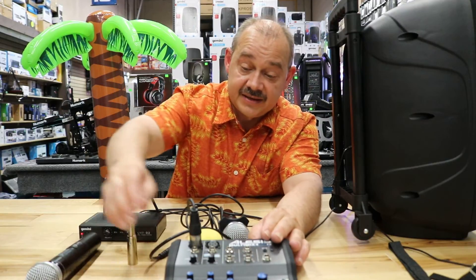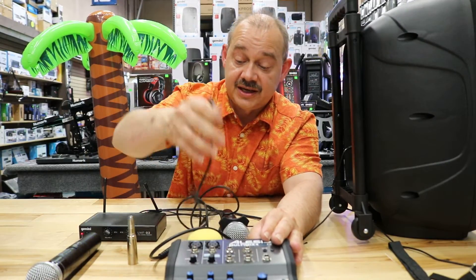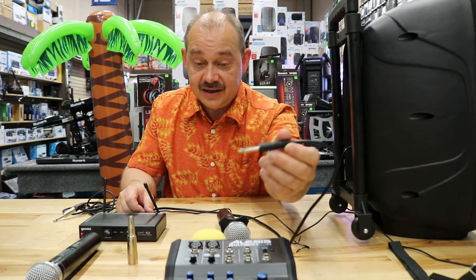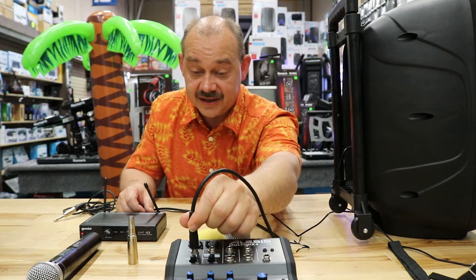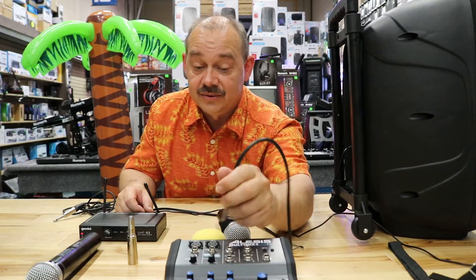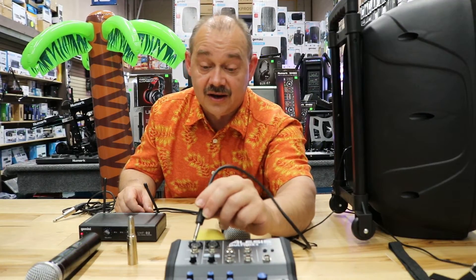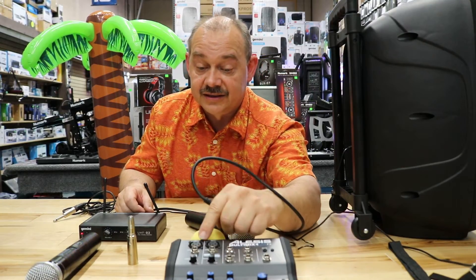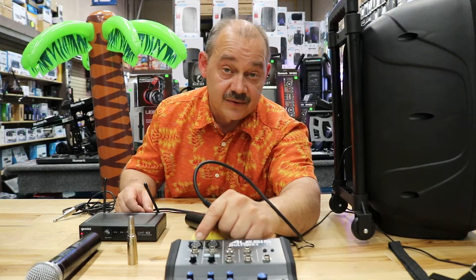That's the only thing you have to pay attention to — make sure you use the proper connections. I get a lot of phone calls, questions, and emails asking the same thing from folks who buy them, and it's a legitimate question. 'I plug the cable that came included into my mixer and my volume is very low.' That's because you've plugged it in down below when you really need to get it plugged in on top where it says 'mic.' Check where you're plugging in, make sure it says 'mic,' don't assume.